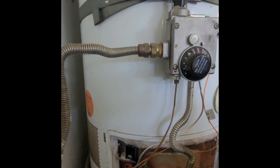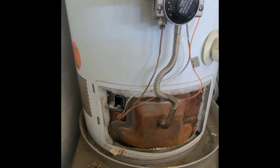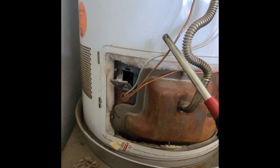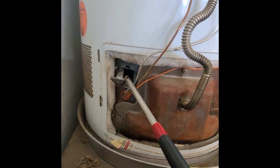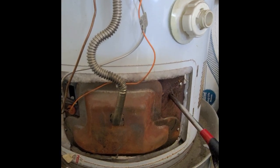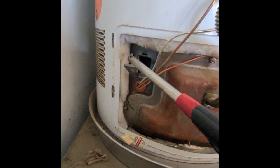The reason I have it set to very hot — we normally use the first or second setting — is because this pilot keeps going out every other day. I know there's an issue with the pilot or this thermocouple, which senses the temperature of the pilot. It may be dirty inside or just need a little servicing, but I would have to open this whole unit up — not just this front burner gas assembly, but pull the whole shell out to access that pilot assembly.